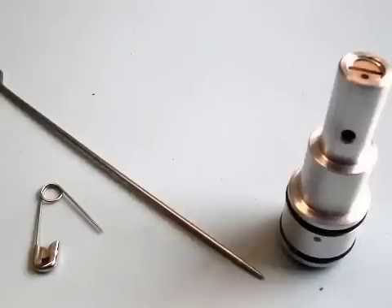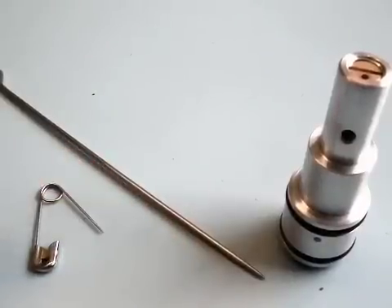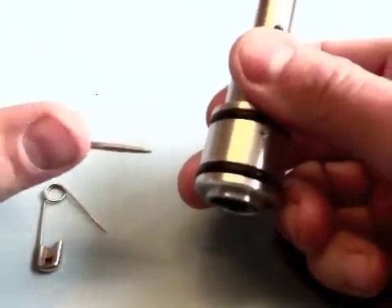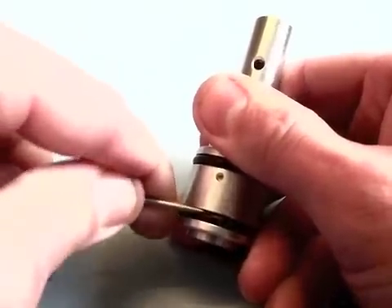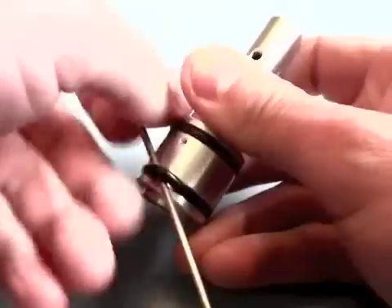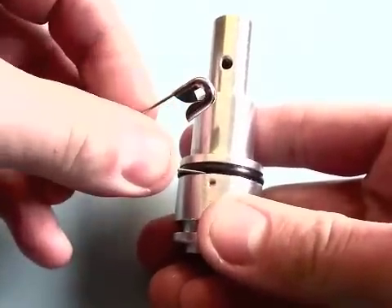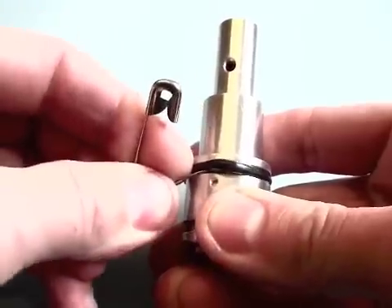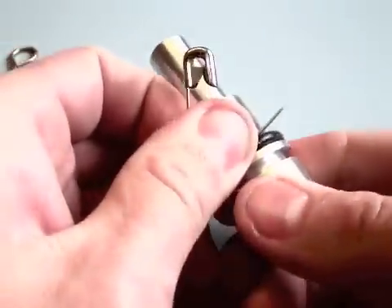Countless times I've seen people struggling trying to get O-rings off of various things - not only air guns but all sorts of mechanical and hydraulic assemblies. All you really need is something fairly strong but small and sharp such as a pin or meat skewer. If you've got the object you want to take the O-ring off, get the pin on the centre line axis, wiggle it down, then twist and bring up underneath like that. Pull it straight off - just put it down the centre, twist it underneath, pull it up and you can simply roll it off of whatever assembly it is.